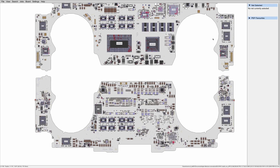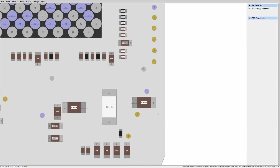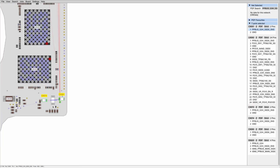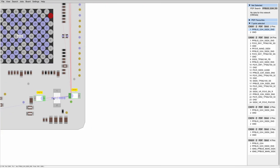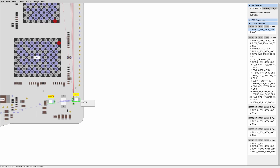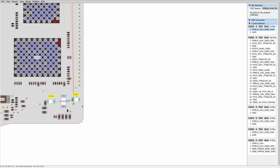Here's our board view. It looks like this one right here — and this is going to be a PPBus voltage-in decoupling capacitor. There's another one right here. It's not really needed, but I will replace it. Stuff like this you really don't need — it's just a decoupling capacitor. All this capacitor does is smooth out a little ripple on the line. It does almost nothing. You could leave these off safely; it's not going to affect the longevity of the board. But I will go ahead and replace it.